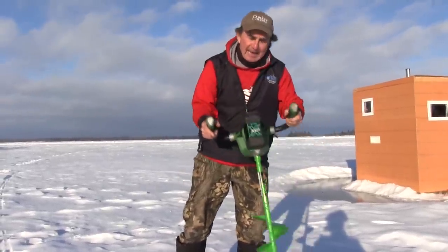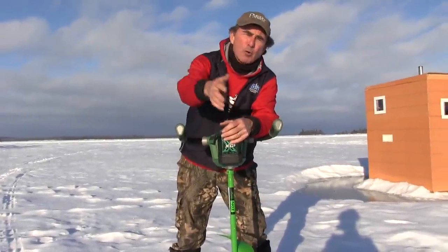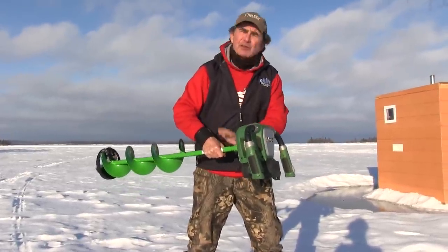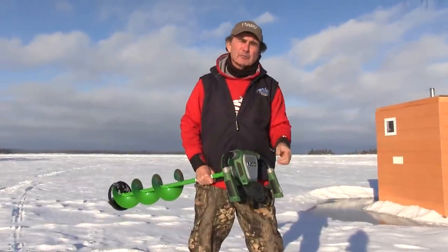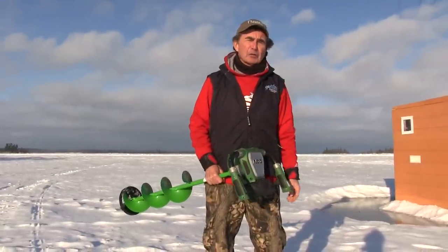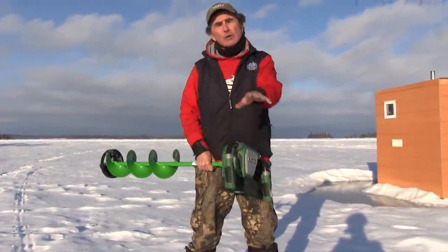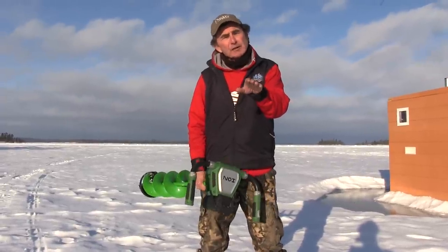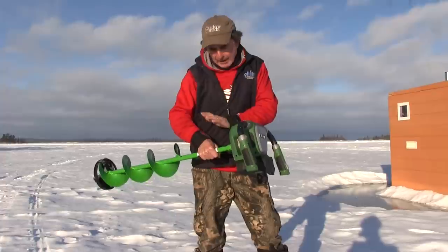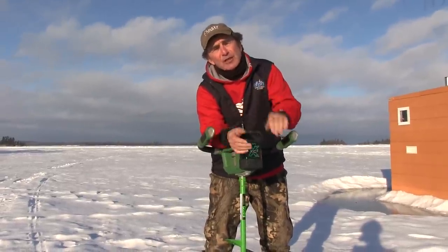One more super important point. As you know, if you're fishing a spot and drilling eight or ten holes, as you walk from hole to hole with a gas engine running, these power takeoffs have amazing torque. A very good friend of mine last year, on a very cold day, had his wet mitt on a gas-powered auger while walking to drill another hole. The engine kept turning, his hand was locked on it, and he almost broke his wrist. And there was a fellow on Lake Winnipeg last year — very same thing happened. A wet glove, gas auger, walking hole to hole with the engine running. His hand was frozen to it, and it tore the tendons and ligaments out of his fingers and wrist, and they had to airlift him to hospital.